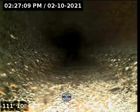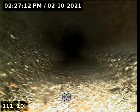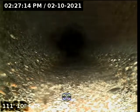You get it at the hardware store. Just add Root-X to your toilet on a seasonal basis, just a little Root-X, and that's acid to roots, and it kills them. Keeps them at bay. But outside of that, we're all looking good.